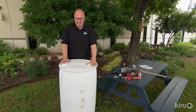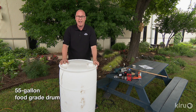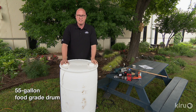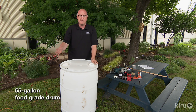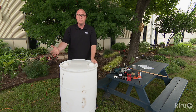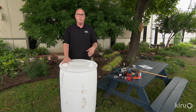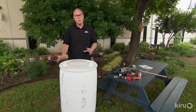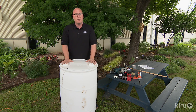What we have here is a food grade 55-gallon plastic drum. This is made from HDPE plastic, the same plastic you use in your milk jug. This one had soda in it, but you can look in your community and try to find them from local beverage distributors. Perhaps you can find them with pickles in them, but you definitely want to avoid any that had petroleum products, soaps, or any chemicals, because we don't want those leaching out of our barrel.